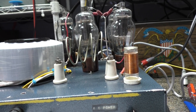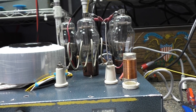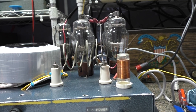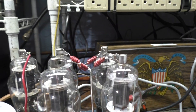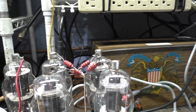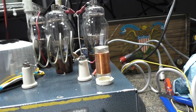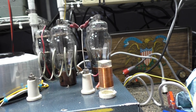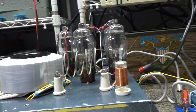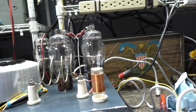What they found was that when you run high voltage or RF through a 6L6, since the plate and all that high voltage came out the bottom right next to the grids and other pins, it would often short and react with the RF coming in along with the grid. So they moved the plate from the bottom to the top, keeping RF and high voltage away from the pins and grids — that's the main design difference.